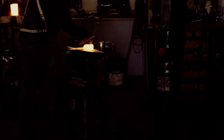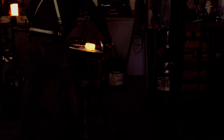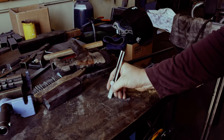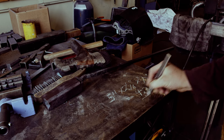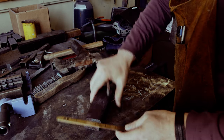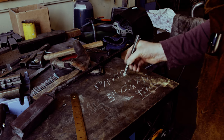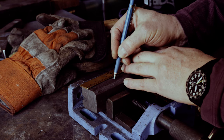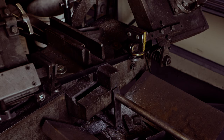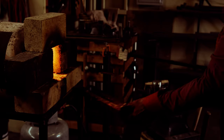This is the final forge welding operation. I am trying to figure out how much material to cut off the billet in order to get one Beskar ingot. I am mostly looking at the total volume in cubic inches and determine based on that how much to cut off. I decided I needed to cut about 2 and an eighth of an inch. At the moment, the 170 layers are all compressed on the side of the billet, and I planned to forge that out to become the surface of the Beskar ingot. If you want to know how much a Beskar ingot should weigh, it is about 600 grams.